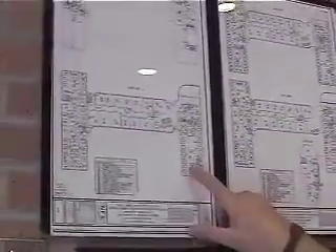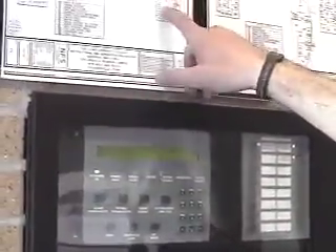You'll also want to verify that the alarm condition has been corrected before you reset the panel. If someone's pulled a pull station, there's a switch inside the pull station that will need to be reset before you reset the panel. We have a building map. When we have a fire alarm condition it comes up with an address number which you can correspond with on this map. So if we had smoke detector L1SO16 going to alarm, it will say that on here as well as 'level one southeast wing,' so you can find it on the map and associate it with the display.